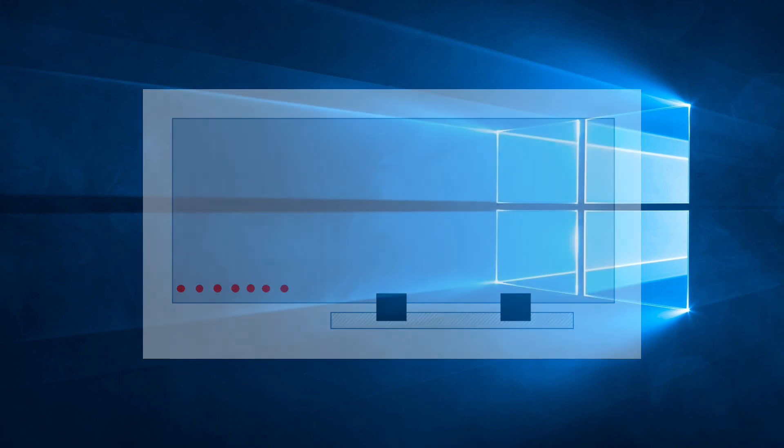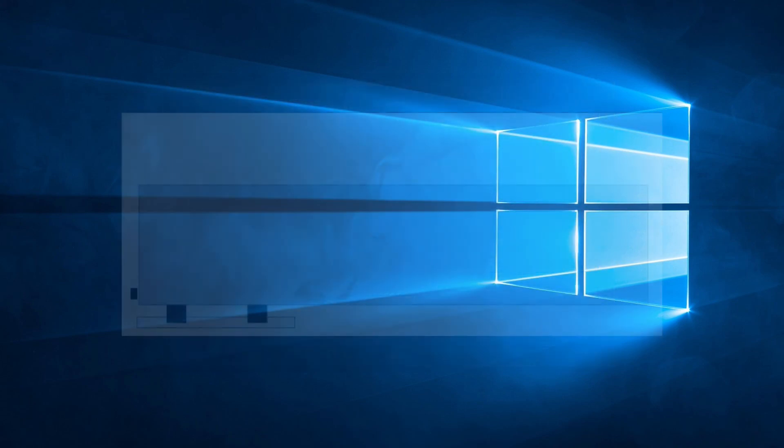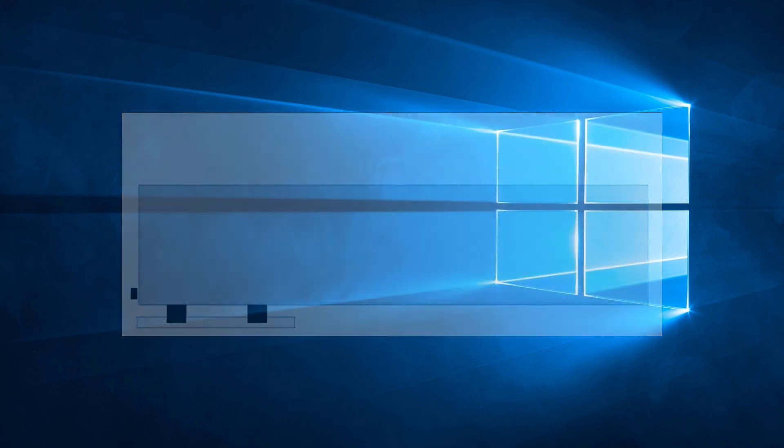Repositioning is not only used to extend the programming area in the X direction — it can also be used to punch areas where the clamps are holding the sheet. You can first punch the area around the clamps, reposition, and then punch the area where the clamps were before. Sometimes repositioning is also used when loading or unloading sheets in an automated environment. Keep in mind that it is not recommended to punch greater than twice the original programming range for the machine. For example, on a machine with a 72 inch programming range, a maximum sheet of 144 inches is recommended. You certainly can punch a longer sheet, though the accuracy of the hits may suffer. Also, it is recommended to reposition only the distance required and make sure a clamp doesn't end up off the sheet after a repositioning move.